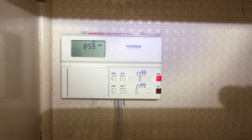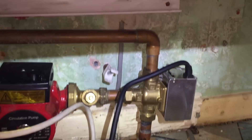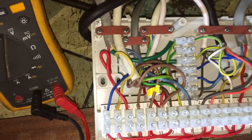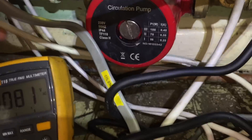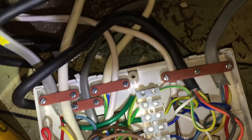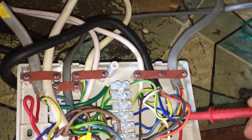On arrival, the programmer is on hot water only — the heating's off. Here's the wiring centre, and it has been rewired by someone. I'm going to gain access to that. It's a pump system on a three-port. Now I've got access to the wiring. As you can see, this is a bit of a spaghetti junction — at least the cables are secure in this one.